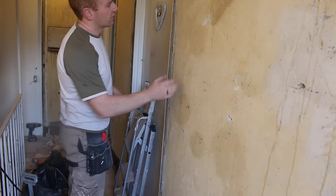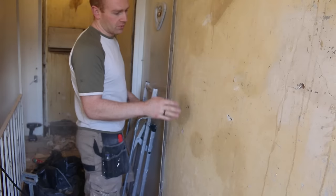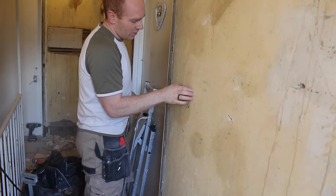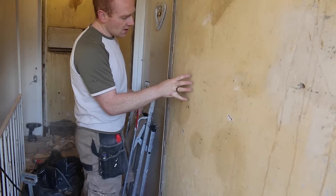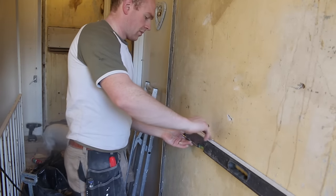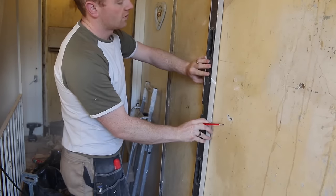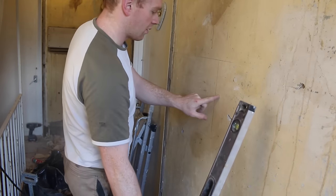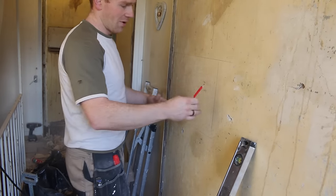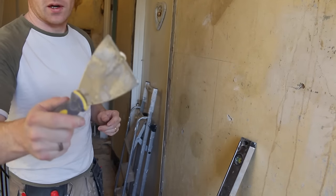Some of it I can use bonding or backing plaster to fill, but for some of the larger areas I'm using a little bit of plasterboard. Here is one of those areas — there's a bump and I'm almost certain that's where the electricians have put the box in for the light switch in the other room, which has pushed it out, and as soon as you disturb one small area it kind of gets worse and worse. You don't have to do perfectly level lines, but I find it's a lot easier when you come to cut the board to fit. It's tempting to take out more than you need to because there's always going to be a little bit of spring. Take it out as carefully as possible, because otherwise you just end up disrupting more and more. We're going to be plastering it anyway so it should hold tight — you could use a sharp blade but it'll just get blunt very quickly, so just use a scraper.